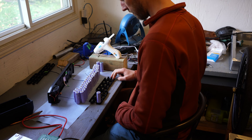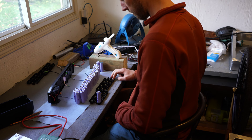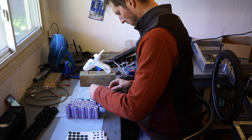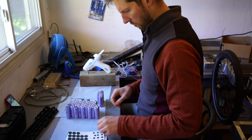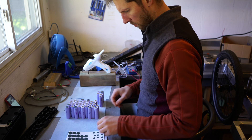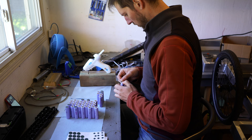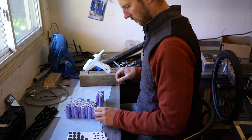As this thing comes together I'm going to need a test battery before I build the big battery. So I've taken apart a battery from an e-bike — I bought this battery a few years ago and one of the cells was discharging faster than the others, so there's something wrong with it. I'm just going to take these cells apart and repurpose this into a test pack that I will only ever use for testing. I'm not going to use a BMS with it, which is really not advised, but I will be storing it in a steel bucket when I'm not using it, outside the house, just in case it doesn't burn down my house.